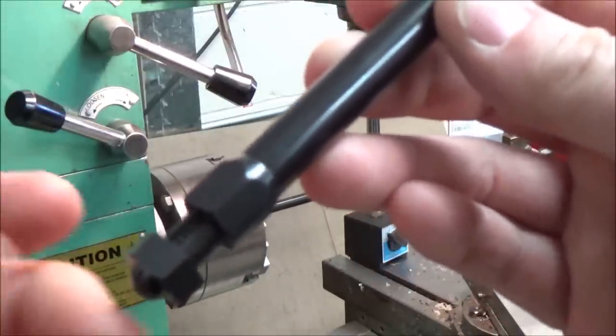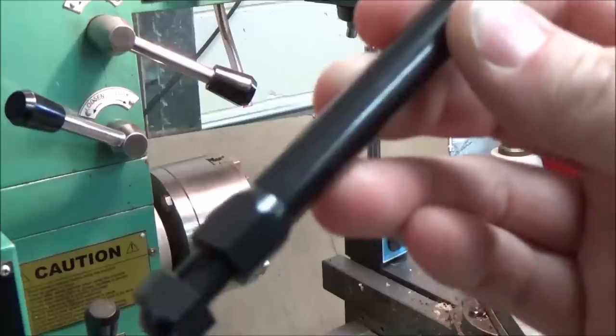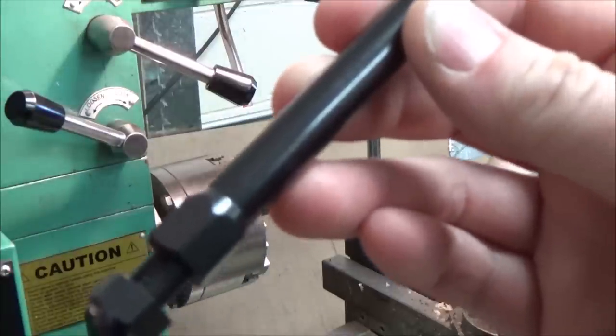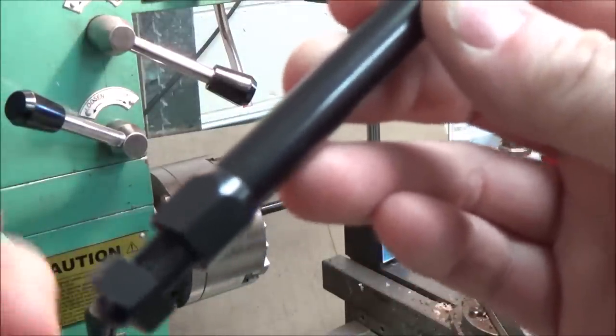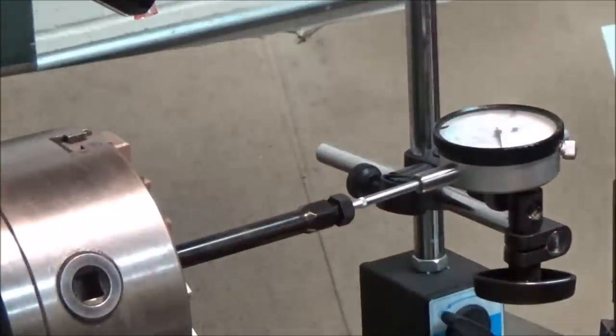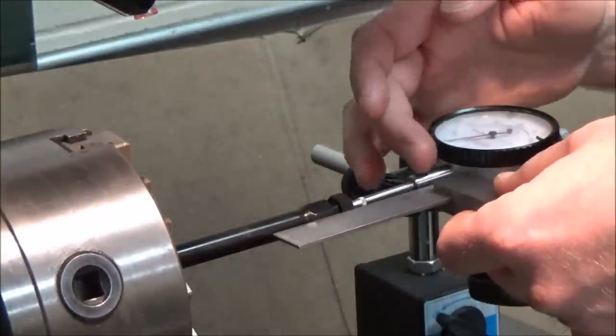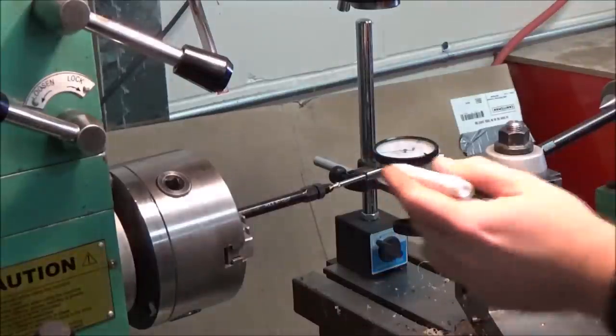So if you have a set of instructions that only gives you flats, what I'm going to do right here on the lathe is pretty cool — to know exactly how many turns and flats are going to equal each other. As I set this up, you'll see I'll use a dial indicator in the lathe just because it's so steady, and you really want to make sure that you're parallel with each other.